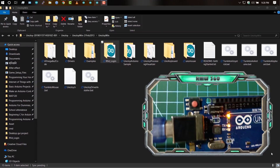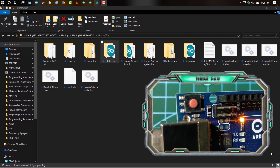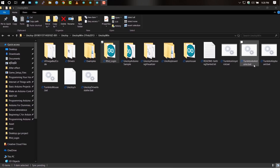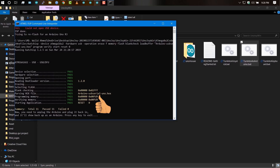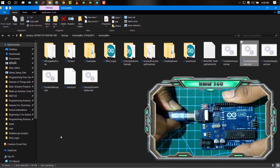Now, if you want to use your Arduino as a microcontroller instead of a keyboard, then touch the reset and ground pins and execute the 'turn_into_arduino.bat' file. Re-plug the Arduino and you are ready to upload new code.